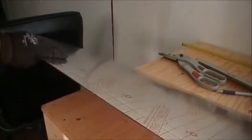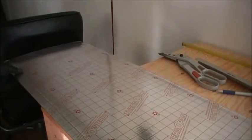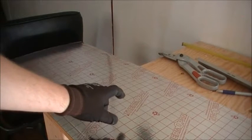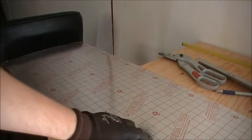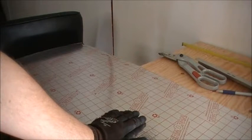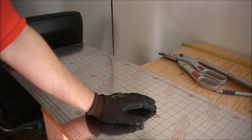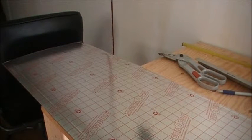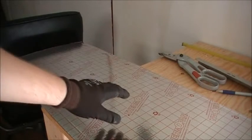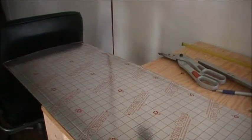The thermal pan is basically a reflective, high-quality cardboard material with a fire rating. This is what I'm going to put underneath the rockwool, and it'll be sealed from the outside with spray foam to lock it into place and make those cavities sealed with more insulation. In the floor I only used two-by-fours, not two-by-sixes, so it's probably around R20 at most. Adding more insulation will help with both cooling and heating.